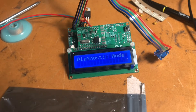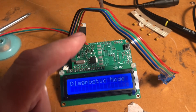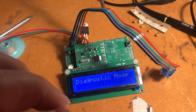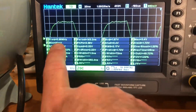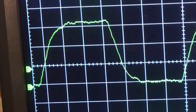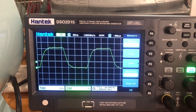We need to get that three-pin regulator attached and get some power to this and see if it actually works. Hip hip hooray — even with all the stuff-ups mentioned we've managed to power it up. It's got 12 volts coming in, three-pin regulator installed ugly style with some electrolytics to clean up any ripple, and this is looking like it's going to work. We've hooked up the scope and in the measure function you can see frequencies at around 7 MHz — switching off measure so we can see the waveform, there it is: 6.999 MHz and it is working like it should. We have a VFO that works. Happy days.